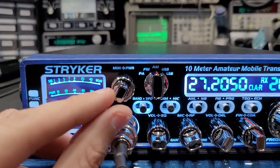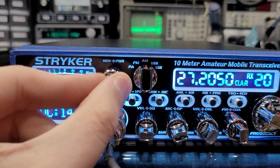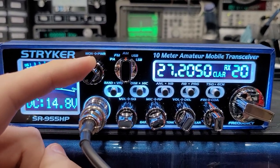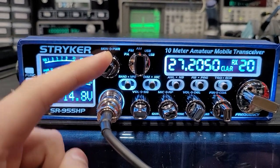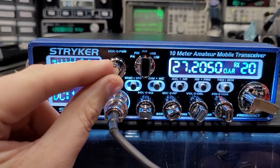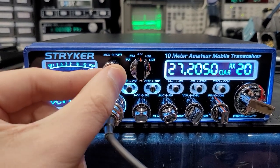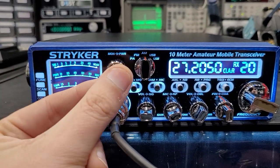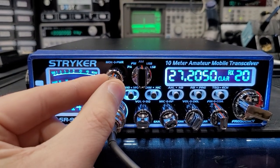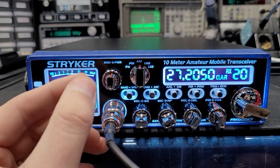This is the talkback control, the small control right here on the front. It's got a little clicker on it. Whenever you're doing your MP3, which you got that option on your radio too, with line level recording and you want to capture your side of the recording so people can hear your voice, like on talkback, you're just going to click that talkback on just barely. If you use it in moderation, you might be able to raise it up some, but you'll never probably be able to go above 12 because it'll squeal.